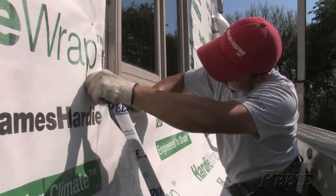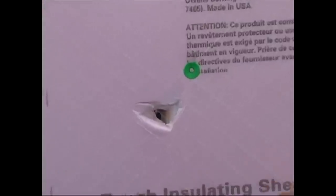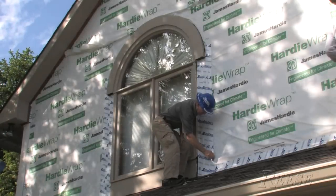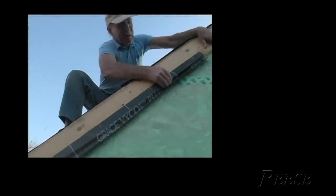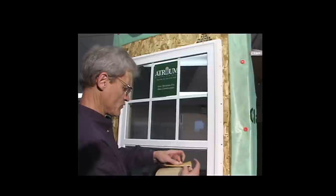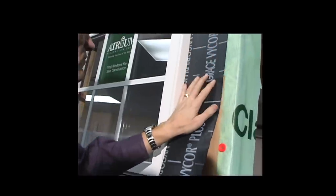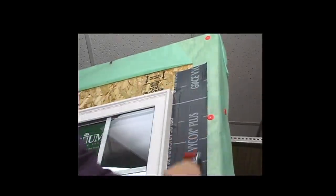I've spent the last 40 years watching houses fall apart. There's just no way to consistently coordinate dozens of different contractors in varying weather conditions, on a budget, with a time schedule, and keep water out of the wall cavities using traditional techniques — it just can't be done. Sure, you might flash a chimney correctly, and if you're a better builder, most of your house wrap will be intact, most of your windows flashed correctly, most of your roof-wall interfaces flashed correctly. But if you want to consistently keep water out of your wall cavities, you need the framing contractor, a flashing specialist, or the roofing contractor to install these tapes at all the places I'm showing you. It's time to use these techniques, price them into the house, let people know you're using them, get credit for it, and start building houses that will last 50 or 100 years.